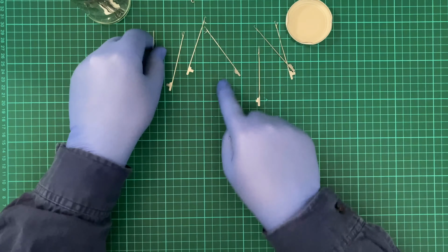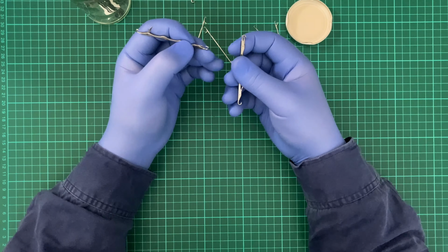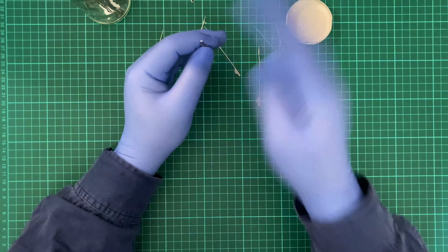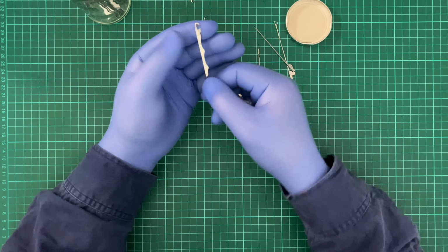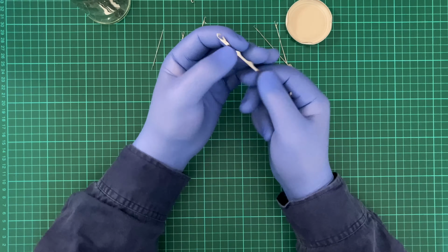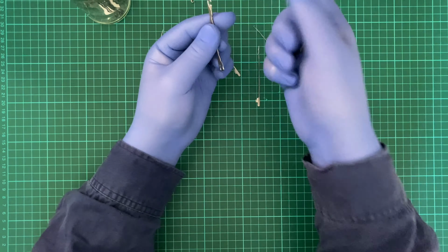Do you really want to have one of these in a large machine that's constantly going mental, and then just completely break down, have to stop, fiddle? No, you want to have it completely running non-stop. And if that means taking them out, here's an example of one where the latch snapped off, and it's on one side. Oh, it doesn't matter, put it in? No. The needle, sorry, hook moves up and down, so it has to have both ends working.